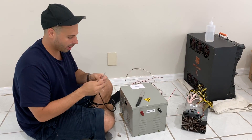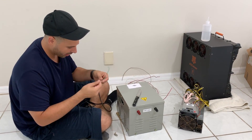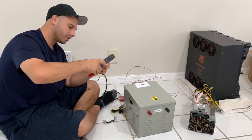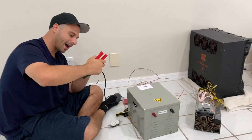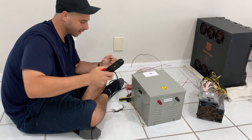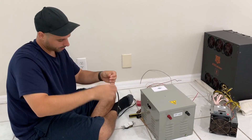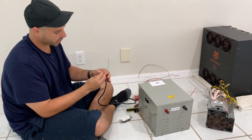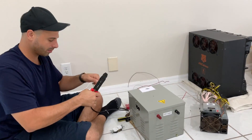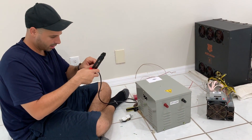Now you want to check and make sure that when you go through these wires you didn't cut any of them. This one looks okay - actually there's a little cut right there, but that one looks okay, and so did this one. You're going to want to strip these wires now. Usually your black wire is going to be your hot wire and your white wire is going to be your neutral wire, but we're going to double-check and test them. This is going to be our ground, which I don't even need, so I'm going to chop that back off and strip the hot wire.